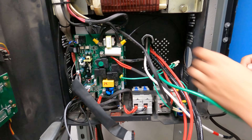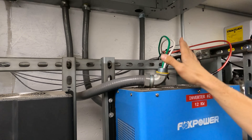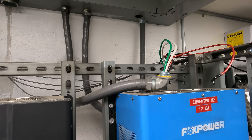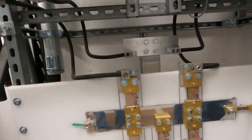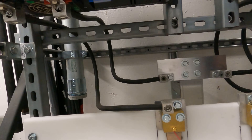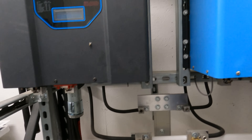So we're ready to take this lock ring off and go from there. I got the seal tight all disconnected. We've got it zip-tied out of the way because I don't want it dangling down on any of my bus bars down here, because this is where I'm going to be working next. I need to get these cables removed from the busing so that the inverter no longer has 48-volt power. From there it's pretty straightforward — we just have to take the screws off the side and get this thing on the ground.